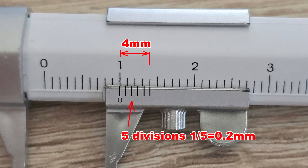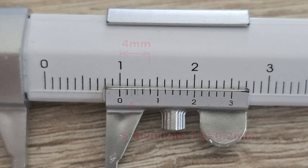It looks like the engineer who designed this pen used only digital calipers, because the vernier scale is just a decoration. If 4 millimeters were divided into 5 pieces, we'd have 0.2mm accuracy — which would at least be useful for education. But as it is, it's purely decorative. Maybe it's only me, but it hurts so much. What's your opinion? I know I have a lot of engineer viewers, especially for this video.